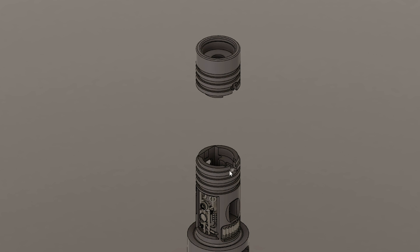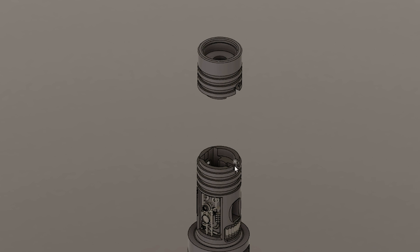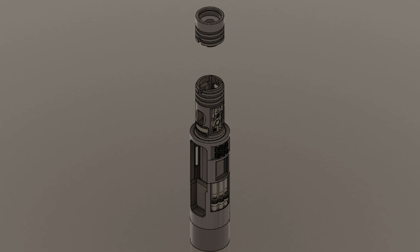There was no way I'd be able to get the USB-C port into the chassis because of how this particular port is designed. This is a very low profile USB-C port — I believe it's from stock — but it's got a thick PCB at the back of it. So I wasn't able to just wire it up and stick it in a hole like I usually do. I had to modify it a little bit. The USB-C port was wired up and glued in place, and then this entire section was glued in place after I wired up the PCB emitter. Relatively simple chassis.